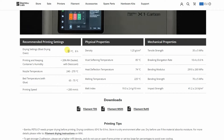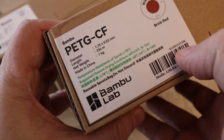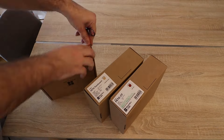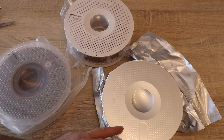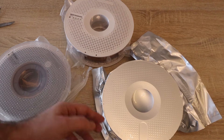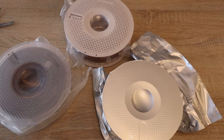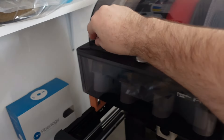It is important to mention that on the website and even on the box we can see instructions for drying: 8 to 12 hours at 60 degrees Celsius. I think most users will not dry it that long. Usually I test PETG out of the box, but I will give it a drying of about 2 hours at 60 degrees Celsius. The carbon fiber version packaging looks more moisture-sensitive — it is a better seal against humidity, and be careful, it is resealable on the smaller side. The AMS is really good with PETG filament because it keeps it dry — the old AMS, not the light version.